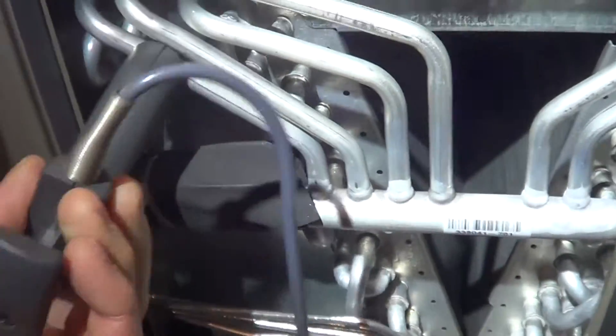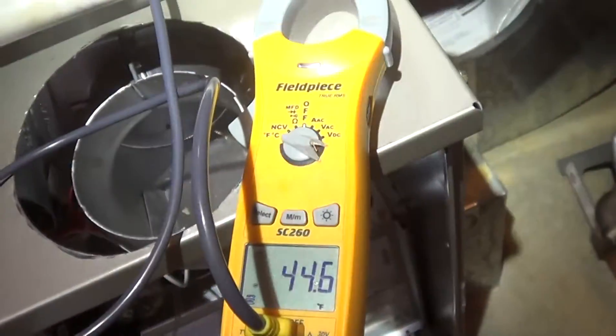We have 45 on the left, 45 on the middle one, 46 on the back circuit, and 44 on the last circuit. Remember, we had a 10-degree difference before. Looking on the thermal scan, it's still overfeeding a little bit, but you can see this circuit is also overfeeding slightly — where you couldn't even see that before. The suction pressure went up. Looking at the tube header, it's much more even. The thermal isn't that accurate, but the temperatures are now reading 49 and 46, which is close.